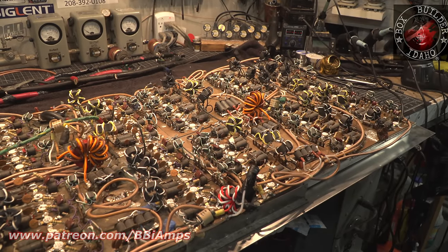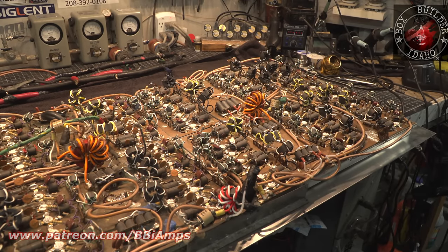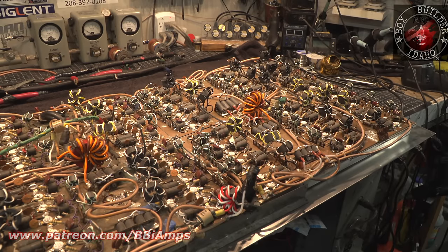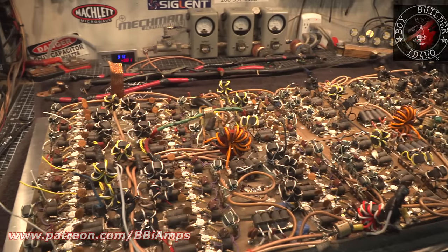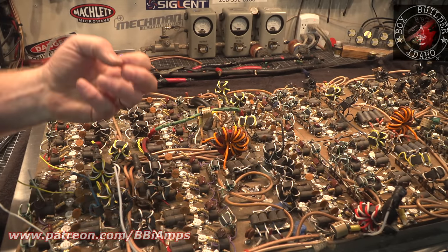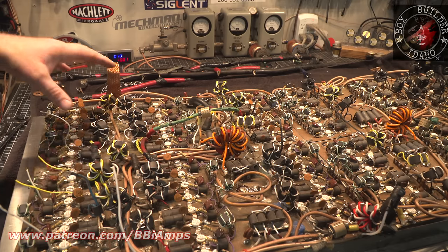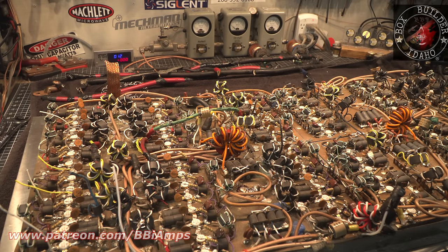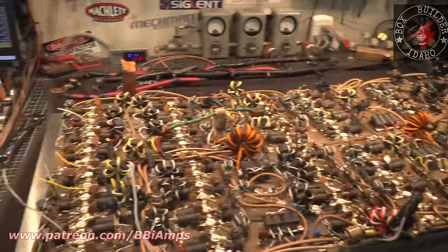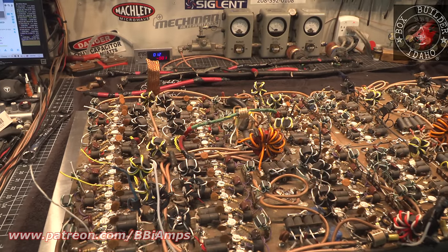What we discovered, and I say we, very tongue-in-cheek, what the builders discovered before I was born, and no, Dave did not do this first. People were building amplifiers long before Dave came along. But what they figured out is the amount of cold air you dump in down there, by the time it gets back here to the back of the cabinet, it's already absorbed as much heat energy as could be transferred to the air. This end of the cabinet will always run notoriously hotter than the front end, just because of heat saturation, right? So cold air goes in, incredibly hot air comes out, because all the energy being transferred to the air is slowly accumulating before it can exhaust out of the cabinet.